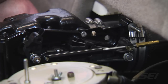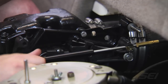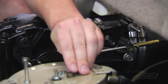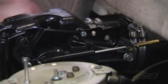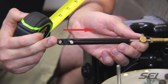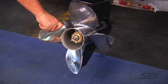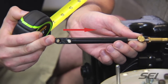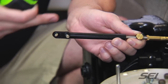Now we're going to remove the lower shift cable. We'll just take off the nut on the front side and the cotter pin on the backside. While removing the cable and pushing the shift cable in, we want to make sure the prop is locking in the counterclockwise position to make sure that it's locked into gear. While pushing the shift cable in the forward position, we're going to measure six inches from the center of the barrel to the center of the hole.